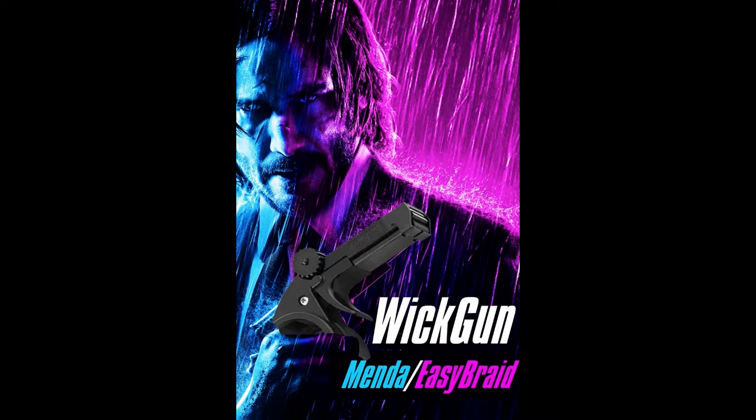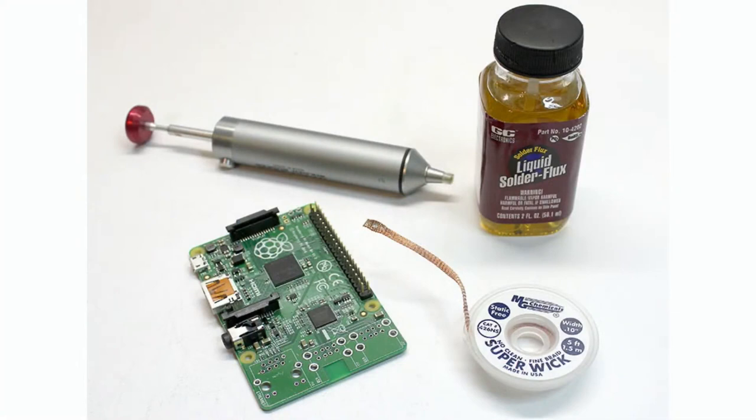The Wick Gun is a tool you would use with solder wick. Anybody who has soldered knows that soldering is super fun and easy until you make a slight mistake. From Phil B's guide on removing headers and connectors from Raspberry Pi — upper left, you've got a desoldering tool, also known as a solder sucker. Top right is the flux, which keeps the area clean and keeps solder from spraying everywhere, making it flow better. And then at the bottom right, super wick — a braid made out of copper with flux or rosin inside, which cleans solder joints and keeps them unoxidized.